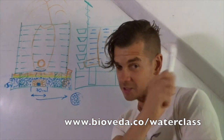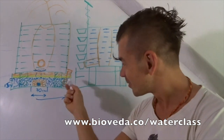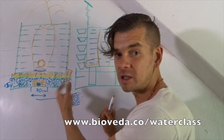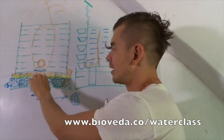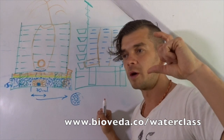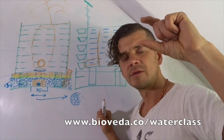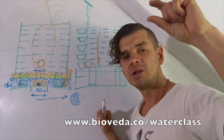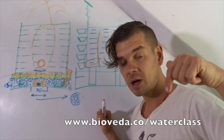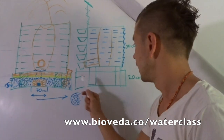That's actually the reason why I'm redrawing this for you, and I didn't even realize it. So I have the pump on the side. About 40 centimeters of rocks, I explained that. So if that's 15 of gravel and 15 of water, your overflow is at 15, then maybe 3 centimeters of sand and then 2 centimeters of soil. That will act as a biological filter, keeping all the smell within the structure and not letting it escape, so nothing will smell. And that's a side view.